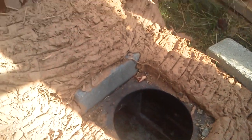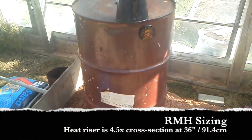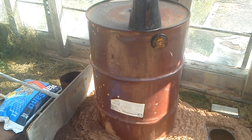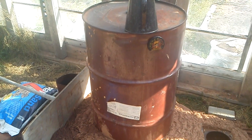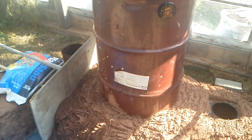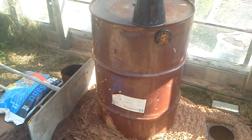It's fire brick from start to finish, so I spent a little bit of money. That's your feed tube and burn tube right there, and then you've got the barrel. The vertical is over 32 inches — I think it's 34 to 35 inches. That gives about an inch of clearance on the inside of the barrel. The whole thing is below grade, and the barrel is one row of bricks higher than the top of the burn tunnel, so that gives me the extra long height.